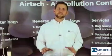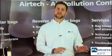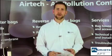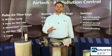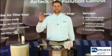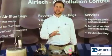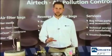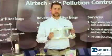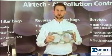When undertaking a filter bag changeout, preparation is key. There are several steps that must be done to ensure the long-term success and viability of your filter bags. Prior to the installation of your filter bags, you will want to inspect the sidewalls, ceiling, and tube sheet of the dust collector. You will want to make sure these areas are clean and free of corrosion or material buildup. Another thing you will want to check is the tube sheet holes to make sure there are no burrs, material buildup, or corrosion.